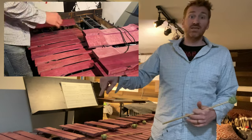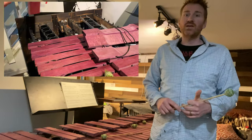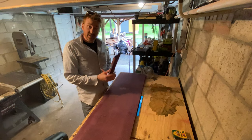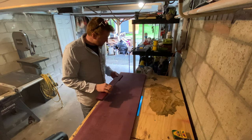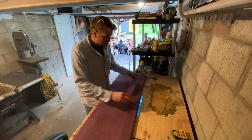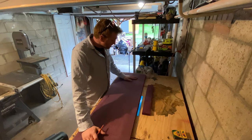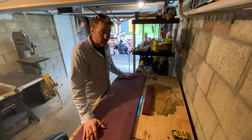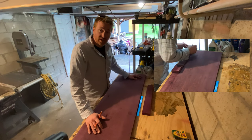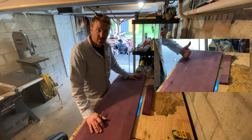Our first step is taking this off the marimba and copying it to another piece of purple heart. I have this massive piece of purple heart, and I just need to get this section out of it. The problem is last time I was cutting purple heart it wasn't completely flush, and because of those warps and bends it almost destroyed both my table saw and my circular saw. I'm going to rough cut this on my band saw, and then once it's smaller I'll put it through the table saw so the edges will be sharp and nice.